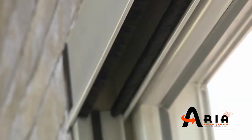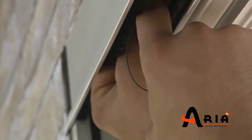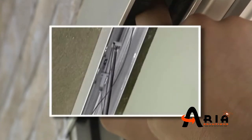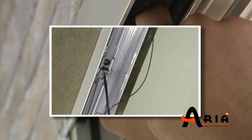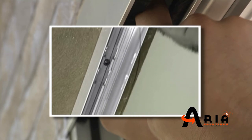For perfect adjustment, cords must be properly installed and tensioned. First, fix the long tensioner through the magnet profile with set screws, and then make the same to the small tensioner on the opposite side and fix the set screws with hexagonal keys.